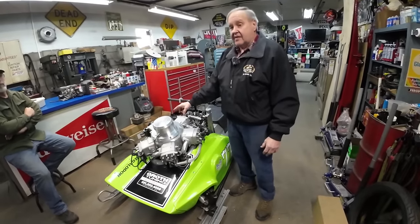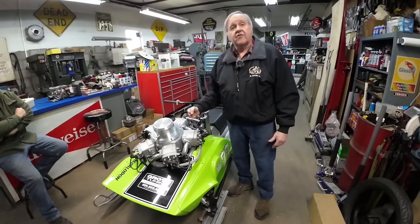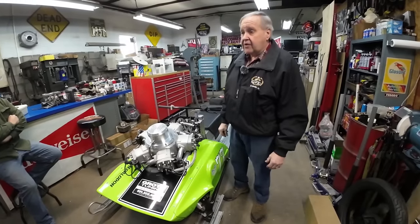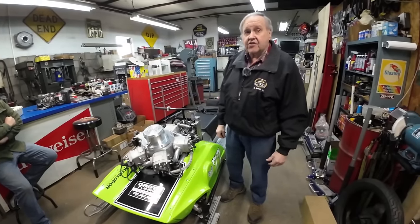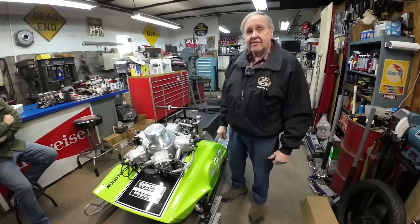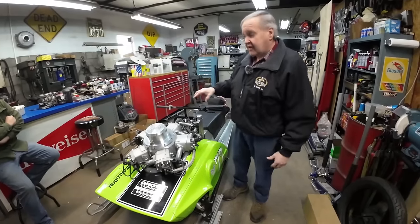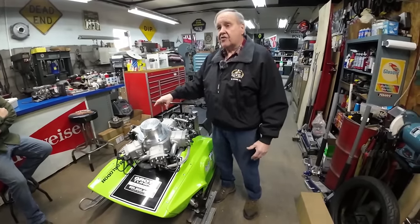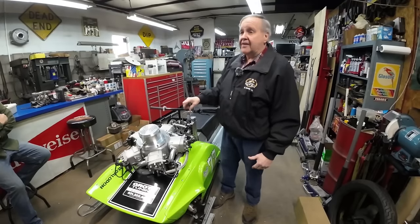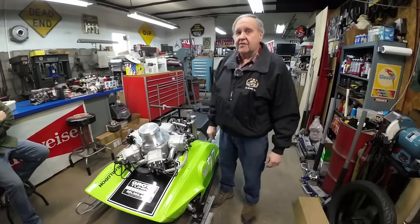But the design is not taken from anybody. The only thing that's similar to a regular radial engine is how the crankshaft works. At Oshkosh, during the big air show, I went through the museum and saw how a big radial aircraft engine worked, with the master rod. You can have 7 or 9 or 5. They're always odd numbers on a radial because with even cylinders the crankshaft tends to get a harmonic vibration, and they're not perfectly balanced anyway. But with an odd number of cylinders firing, they run pretty good.